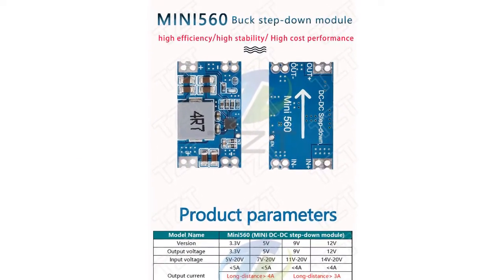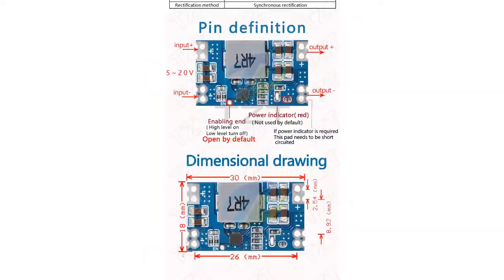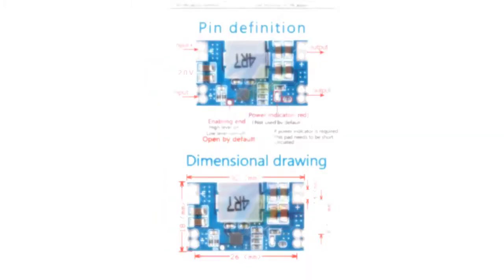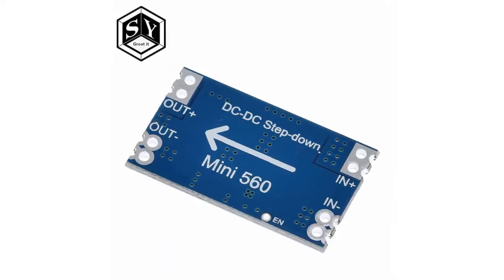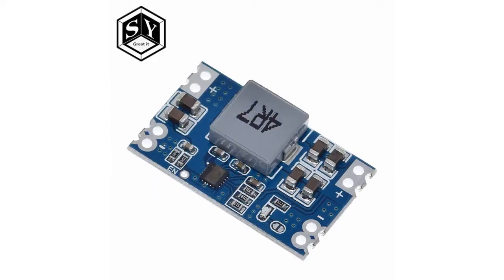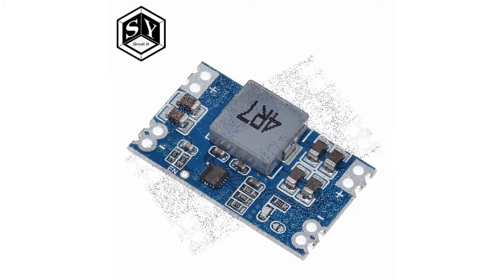However, it will aid to shorten the ringing that can take place during particular step alterations. If the output is at low levels, which can be caused by voltage reduction or increasing the load current, the regulation factor will be controlled to make a higher output voltage. But this can only be completed to a specified level. If the output voltage is too high then the regulation element will be commanded to produce a much lower amount of voltage.